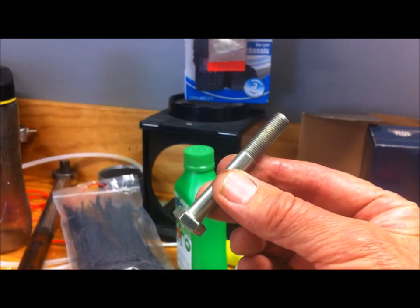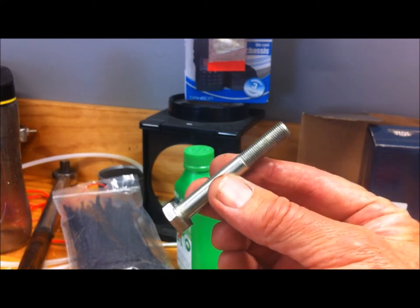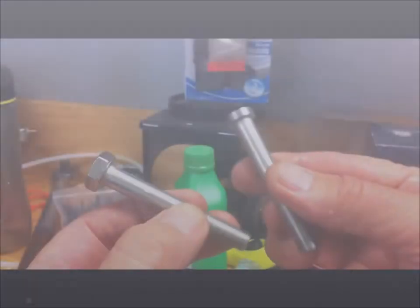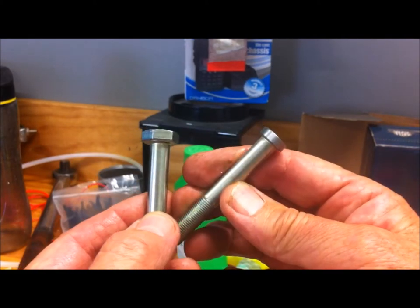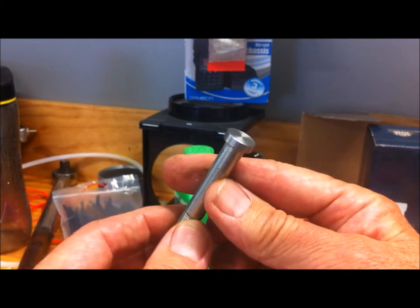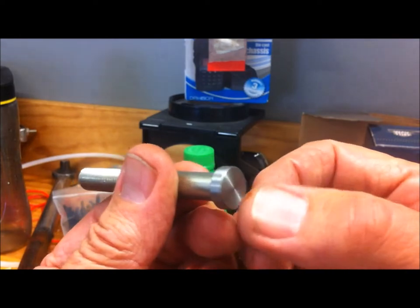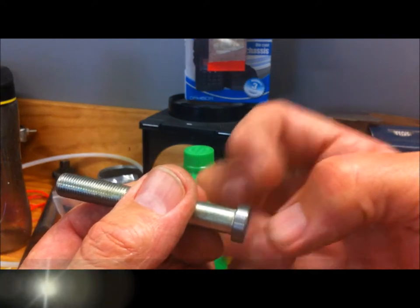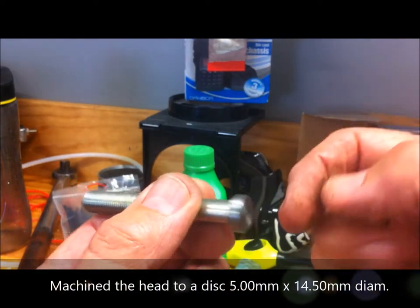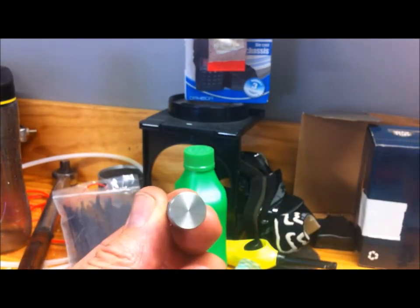I've purchased a 70mm long high-tensile automotive bolt, M10 with a 1mm thread pitch — I bought two of them. This is the one I've modified. I stuck it in the lathe and machined the face of the bolt flat. I've made the head five millimeters thick, and the diameter needs to be 14.5mm, which matches the diameter of the end of the hydraulic adjuster.